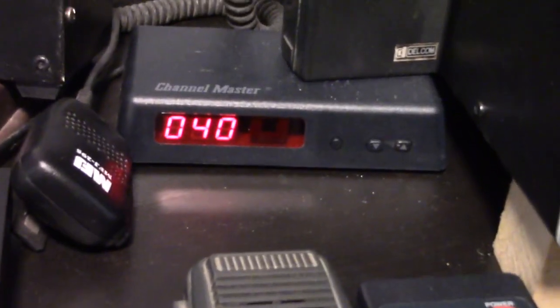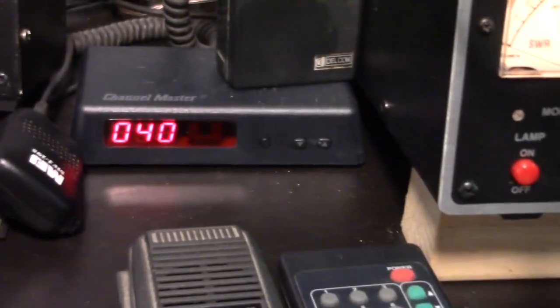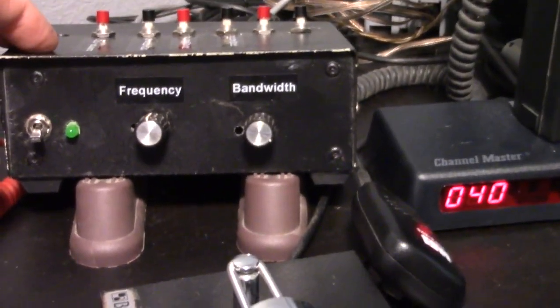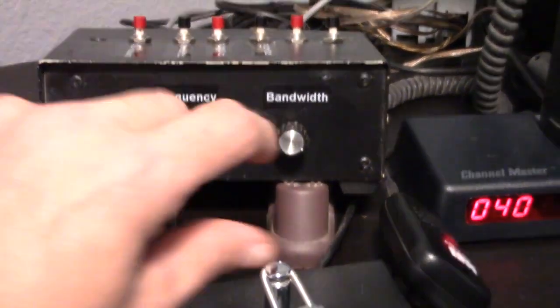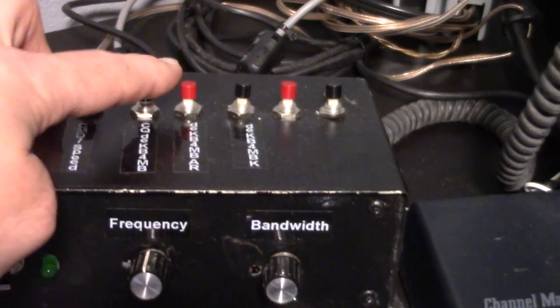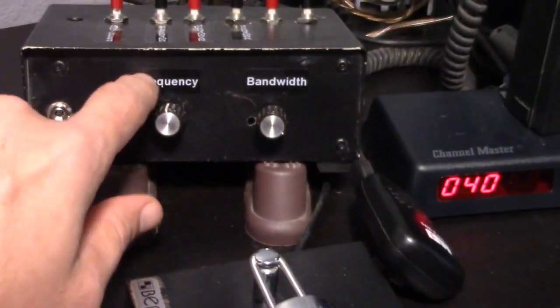Right here is my rotator control. The neat thing about it is it's cheap and parts are readily available, and I've got a remote so I can just dial in an antenna direction change with the remote. Adventure paddles here are for Morse code. And this thing over here is something I built — it's the SCAF kit, a filter so I can listen to Morse code and change the bandwidth to really only hear the one signal I'm interested in. There's also a keyer built in that I put all in one box. When it's on, I'm listening through the SCAF.